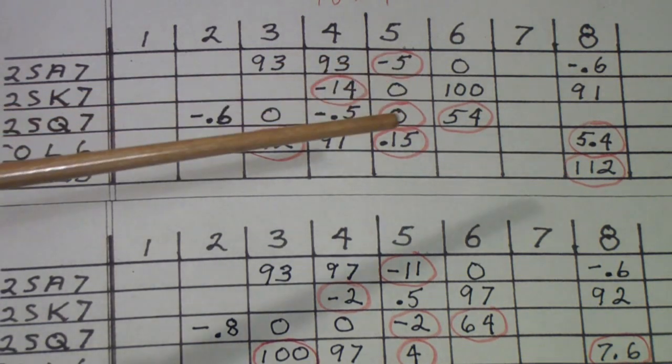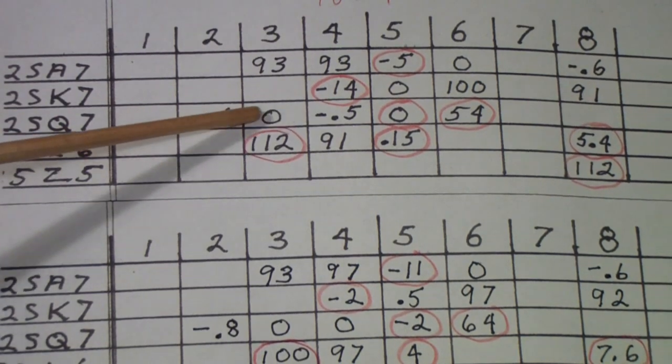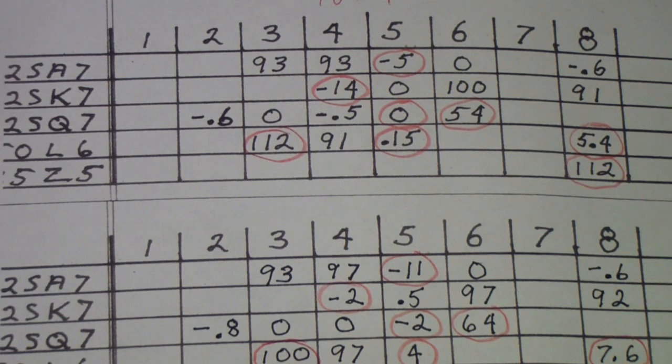For example, on the SQ7 there are a couple of diode plates used for the AVC and the detector, and then there is a grid, cathode, and plate that is used for audio amplification. We'll talk more about the circuit at a future point. These are the values I read in the 1024, and basically I didn't see anything in these readings that caused me any great concern. But one of the things we're going to do next is turn on the radio and see if it actually works.